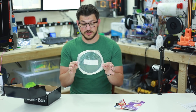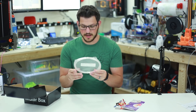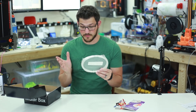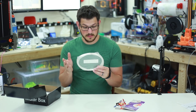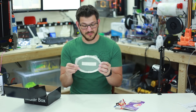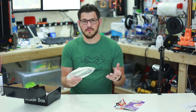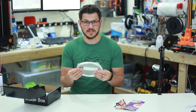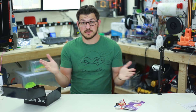And the very last thing is we have a pre-packaged one from FormFutura. The previous filaments that came from FormFutura all came in this little packaging here — I'm guessing these are just the samples that you would normally purchase if you went through them, and MakerBox has a deal with them. This is CrystalFlex by FormFutura again, super duper clear looking, and it is clear. Print temperatures 230-260°C, and it's 50 grams. I really don't like that they do this — I wish MakerBox would take one of their stickers and slap it on this. I know it's a little extra work, but if you're going to put this in the box, put the sticker on there. So MakerBox, you guys should look into that. Anyways, that's the four filaments. Let's warm up the printers, get them printed, and see how they all turn out.